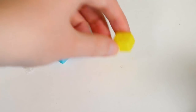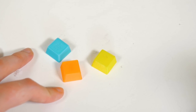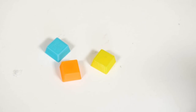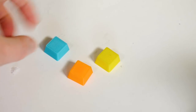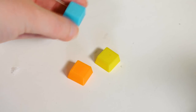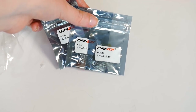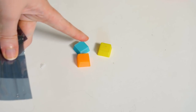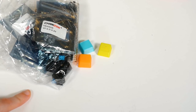We're going to wait until this afternoon when the mail comes and then solder everything up. Just got word that the boards arrived. I turned out two more keycaps — a yellow one and an orange one. I'm going to do a multi-color thing: there will be four commands that are a little more risky — sudo apt-get update will be yellow, upgrade will be orange, reboot will be red, and shutdown will be black. Then I'll have some fun ones at the bottom: blue, pink, purple, green — kind of a fun rainbow effect. I forgot I had multiple colored three-millimeter LEDs; I'm going to match the LED color to the keycap. The PCBs are in — going to go solder those up. Here's the PCB — eight MX switches, everything fits, which I'm pumped on. I had to make it slightly bigger than a standard shield size because of the MX switches, but it doesn't increase the footprint too much. First I'll solder up the resistors, then the switches with LEDs, then the headers.